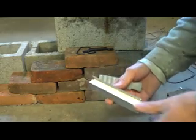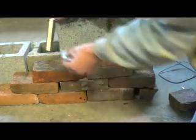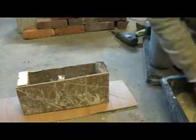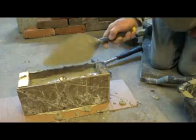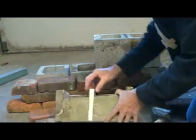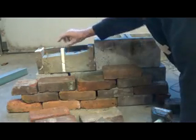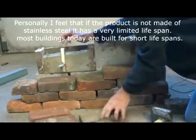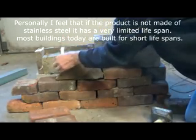There's one more type of wall tie — this one goes into a concrete wall using a styrofoam insert. We put it inside this little box and fill it with concrete — just pretend we're pouring — and let it dry. Now you can see how that's embedded in there. This is typically used on concrete retaining walls, bridges, things like that. The styrofoam lets you shove the tie in and turn it to whatever height your brick or stone needs to be, so you can always adjust the height.